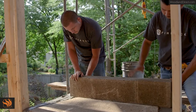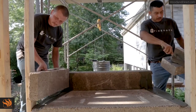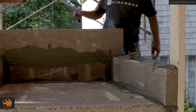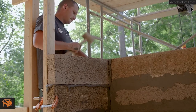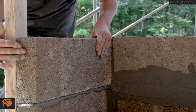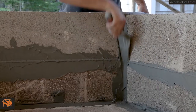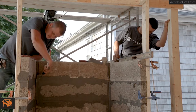Next, place a back block on the base plate, then place a side block on either side of the back block. Components should be covered by approximately one half to one inch of mortar so as to result in a one-sixteenth to one-eighth inch joint when stacked. It's normal for mortar to ooze from all sides when applied correctly. Use a trowel to smooth this excess mortar across the joints to create an airtight seal — we call this buttering the joints. Keep building in this order to completion.